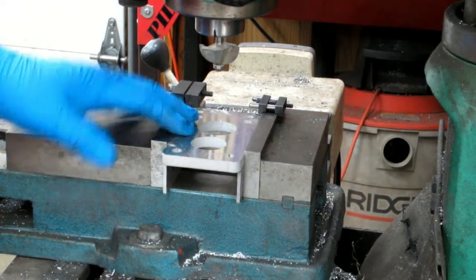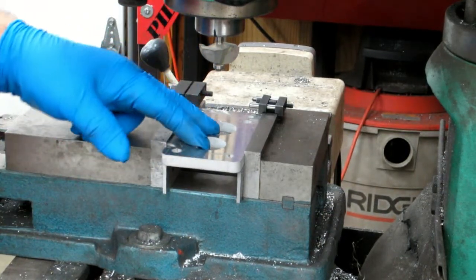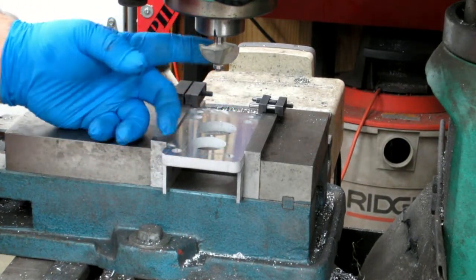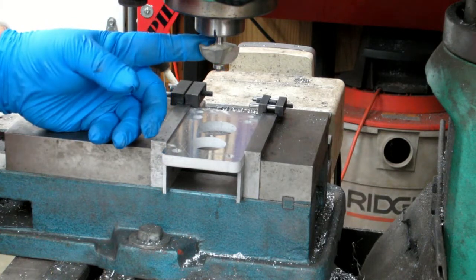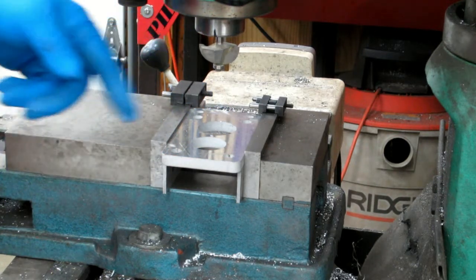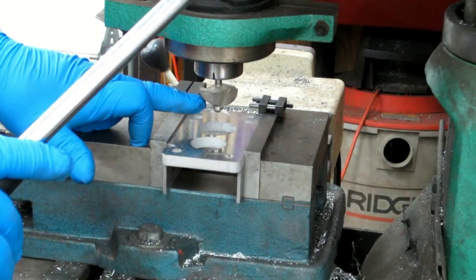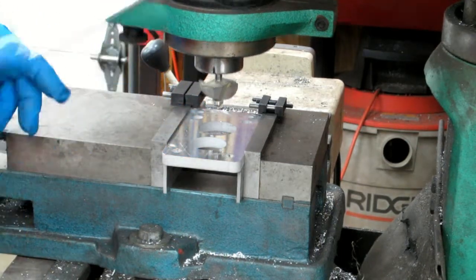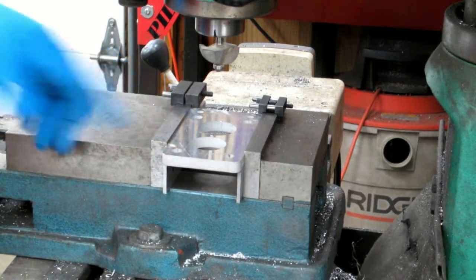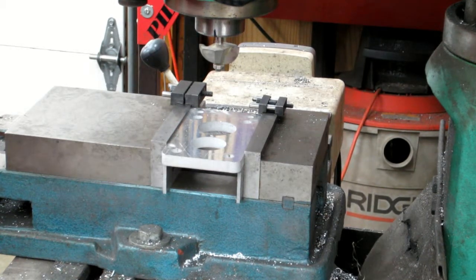I'm sure everybody's seen guys on YouTube and stuff like that using carbide router bits to machine aluminum rims and that kind of stuff. So basically, that's what I'm going to do here with a router bit. I bought one yesterday for like $29-30. It turns out I had the equivalent one here in the shop, so that one's going back. But this one is just a hair bigger than that hole, which means that by the time I get down 3/8 of an inch in there, that's going to create a little bit of taper, that taper that I think I pointed out on the last one. But we'll see. Now I've got the speed turned up on the mill to basically as fast as it'll go, 2500 I think.